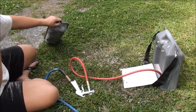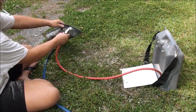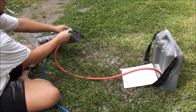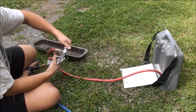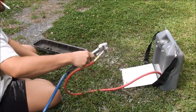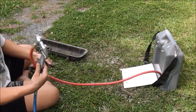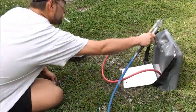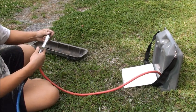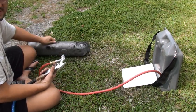Sandblasting also helps get rid of that blasted, messy silicone that somebody put on there. The only bad thing about this is I'm not running a water separator or an air dryer. You can see it stops up and you've got to bang it on the ground a few times to clean it out. It's not that big of a deal — you do have to do it every so often, clean it out, put it back together. I'd say it's that way with any sandblaster.